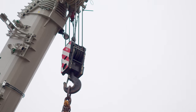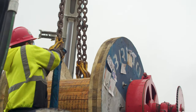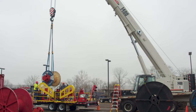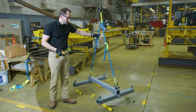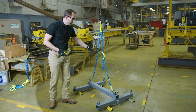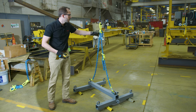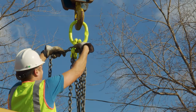And if you have 10–20 lifts in a day, that's a lot of time lost. If you have three guys working on the project, you're going to lose a lot of man-hours in a day just trying to balance out your loads. So when you're lifting an uneven load — such as precast concrete stairs — and you're lifting different loads on the work site, having the mid grab in addition to the ability to do your major adjustment at the top really improves efficiency on the work site.